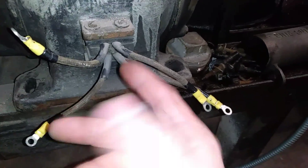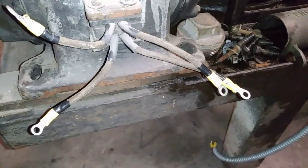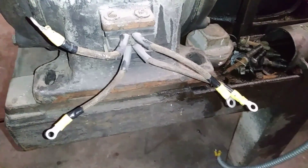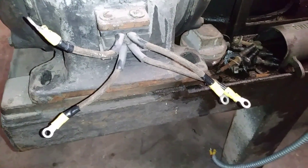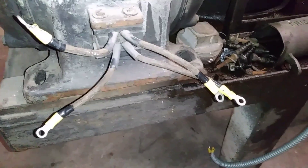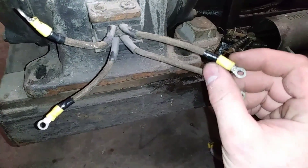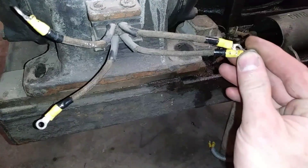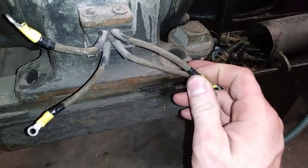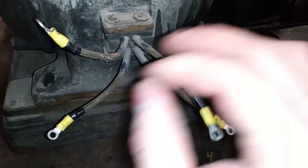You can put the bottom two together with the top two as your supply, or put one side together with the other side as your supply. This is great because even though nothing's labeled you can't goof it up. If you think you might have wired it wrong, just jog the motor for a second — it won't run backwards. If you've wired it for 220 and plugged it into 110, it'll just take a long time to get up to speed before the brushes kick out.